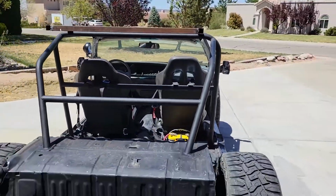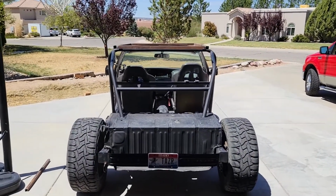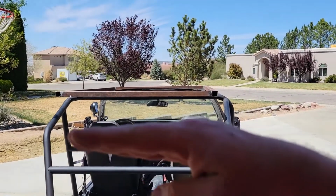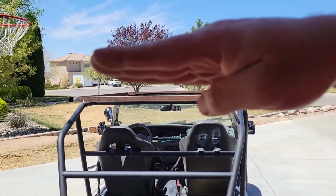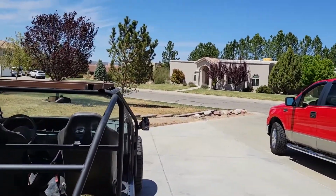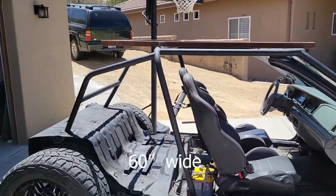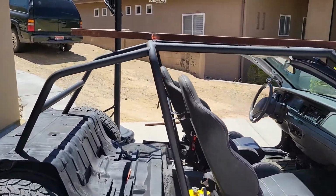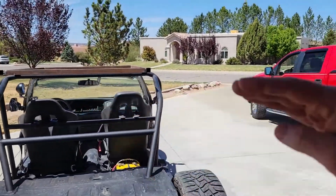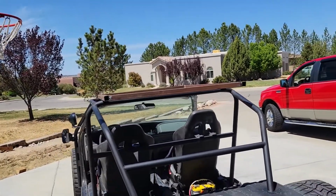But basically, what would happen is I'm going to build a second one just like this one. This one's like 4 foot by 6 foot approximately. So I'll build a second one, and then the second one will set on top of it here, and then it will hinge out. So it'll form a platform that is 6 foot wide this way, and then I think it ends up being like 84 or 88 inches coming out this way with a ladder on the end, which supports the other side.